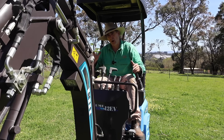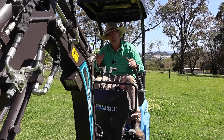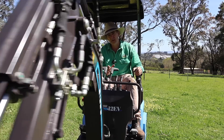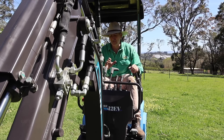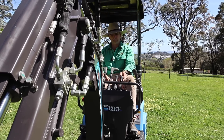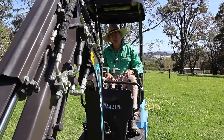One thing I've been critical of electric machines coming out of China for in the past has been a complete and utter lack of operator safety in terms of cutout switches or shutdown. You would literally be able to get off the machine and operate all of the controls from standing on the ground, which with a machine that swivels is never a good idea. Well, the UME has solved that really cleverly. As soon as you get up off the seat, she shuts right down — none of the controls will work. But as soon as you get back on the seat, it's party time. Safety that's actually intelligent and doesn't make you go through a whole shutdown procedure.